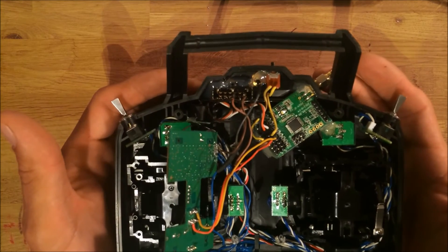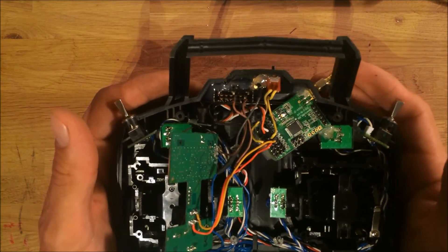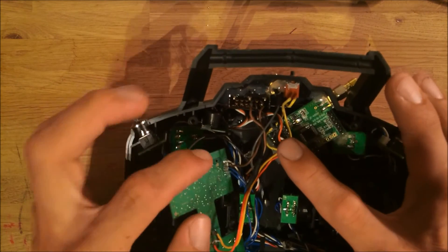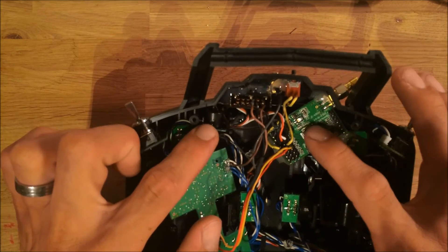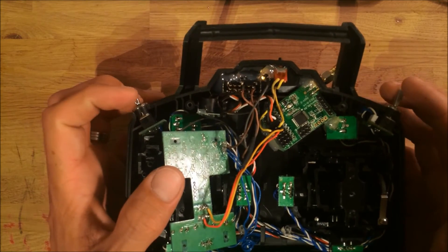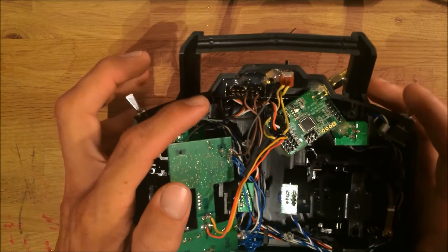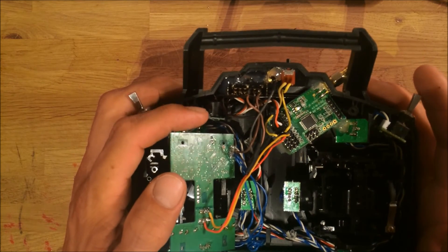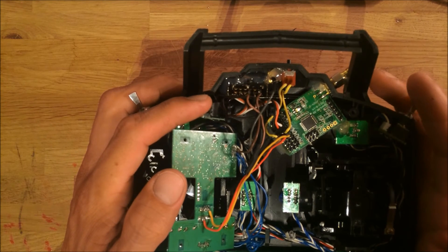Also on my webpage, RCcaptain.com, you can find a tutorial on how to do this. Besides this, I've connected a buzzer, because this unit is flashed with a telemetry backlink — as it's called — which means that if I get bad reception or it loses packets, this will start to beep. The worse the reception is, the more it's going to beep, so I know when it's time to turn back and head home.